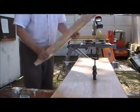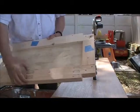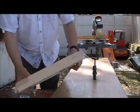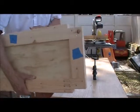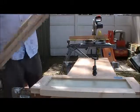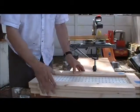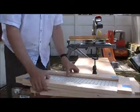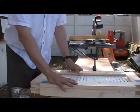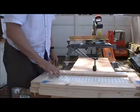The legs for this — I lap jointed a couple of 2x4s, which I trimmed down the sides to approximately 3 inches wide. Then I lap jointed these pieces together and screwed them down along with some glue. This one's got a solid panel in it. I've got a second one that has perforated board so I can hang stuff on the end. The plans for these legs came out of a woodworking magazine. I'm just modifying it because it was for a different type of setup.